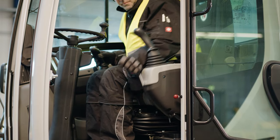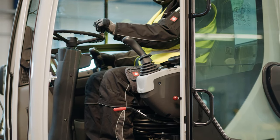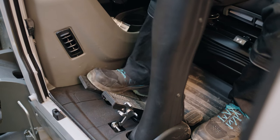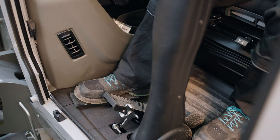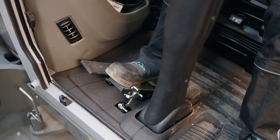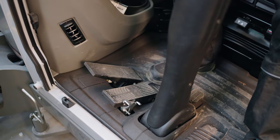Only then fold down the joystick carrier with the red handle to make the machine ready for operation. The accelerator pedal is located on the right. The brake is located alongside to the left. To lock the oscillating axle, depress the brake pedal fully until it engages.